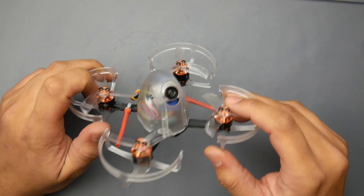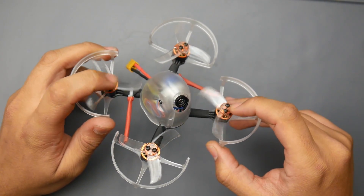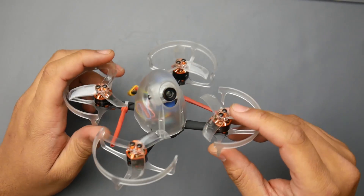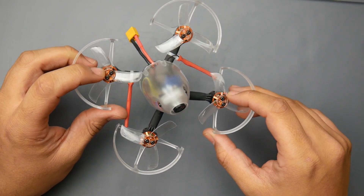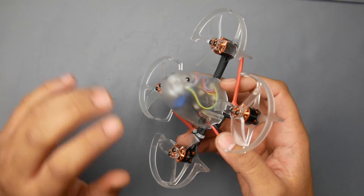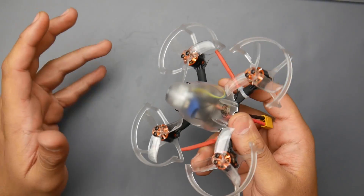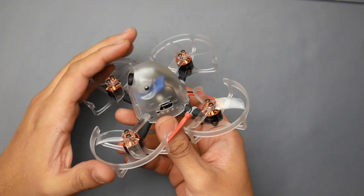Something that I really didn't like, T-Motor — why are you using an F3? Now, it's not really a big deal. We're using an MPU-6000 gyro on the F3. But hopefully it will also be future-proof if the Betaflight developers continue to support the F3 microcontroller units. So take that into consideration before purchasing this.